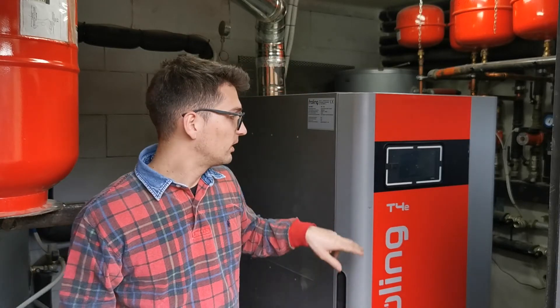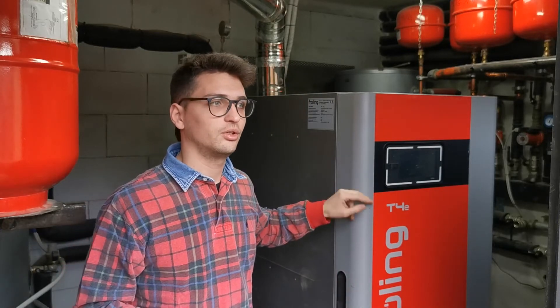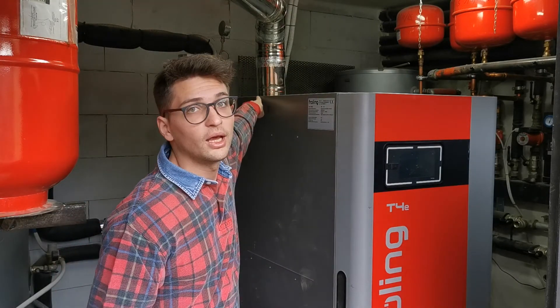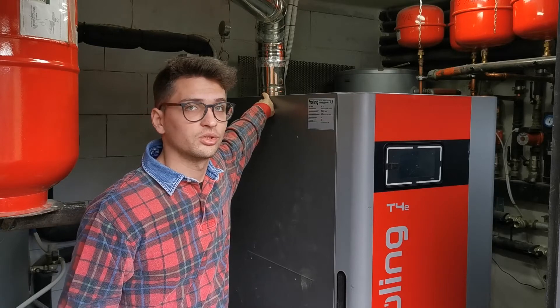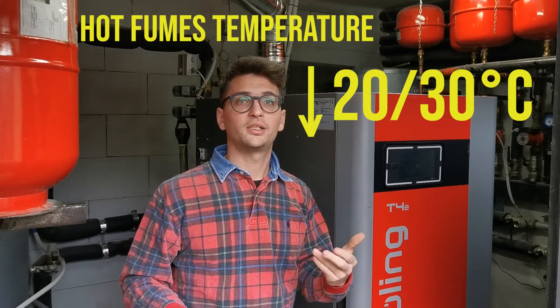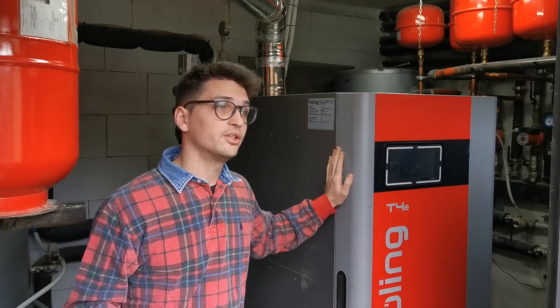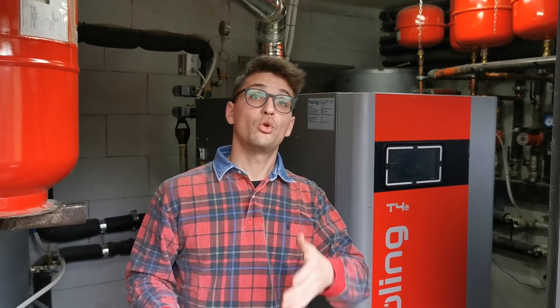After restarting, we quickly looked at boiler temperatures. After the cleaning procedure, the hot fumes coming out at the flue line temperature sensor are 20–30 degrees lower than in the uncleaned state. This means the efficiency of heat exchange has improved significantly. You should perform this full cleaning procedure at least once per year, and ideally twice. Thank you for watching — subscribe to the channel and look out for upcoming videos.